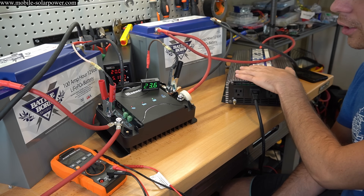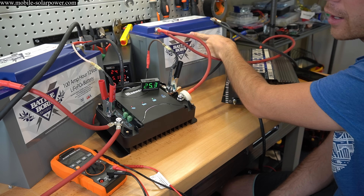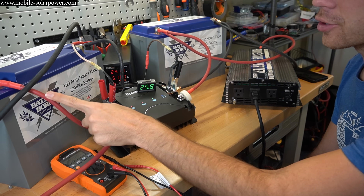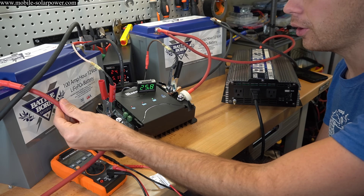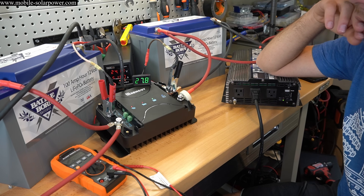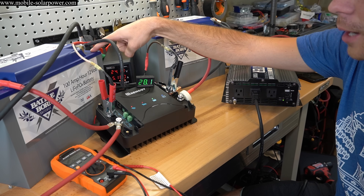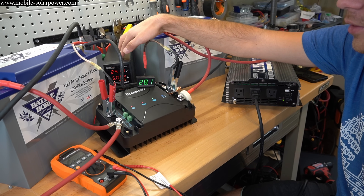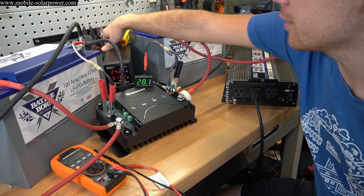For the next test, we've connected a pure sine wave inverter with pure copper cable to the solar battery and will put a load on it to see how many amps flow through this unit. Right now I have simulated solar power and a battery charger on the starting battery to mimic a vehicle driving with both solar and alternator available. It's already pushing 25 amps. Adding a load brings us to 27 amps at 13 volts — consistent with roughly 5 to 7 amps at 12 volts after losses from the 20-amp charger.